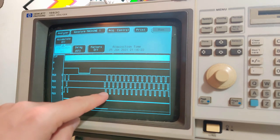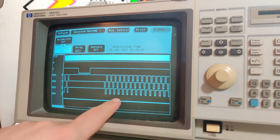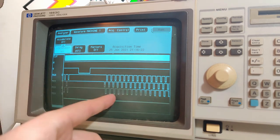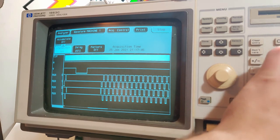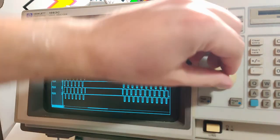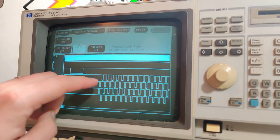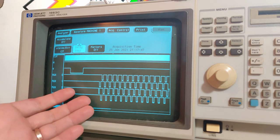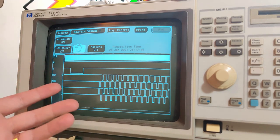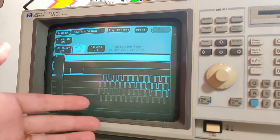And so it's going low, low, low, and then presumably this one would also be going low in this slot. That one must not be connected correctly. Let's see. Yeah, I think I was off by one pin. There we go. Okay, so we can see a good pattern here. It goes this one, this one, this one, this one. So it enables that channel, that channel, that channel, that channel. So if we plug this into our multiplexer, we should at least get regular garbage out of the memory if we hold the memory address stable.